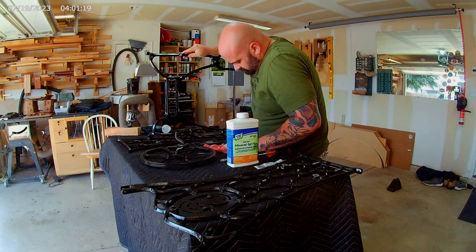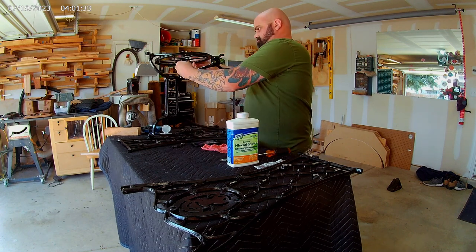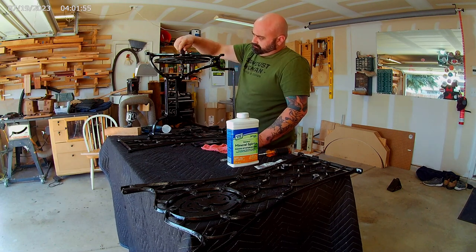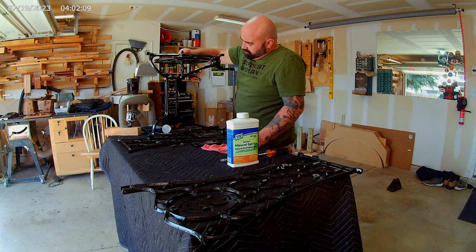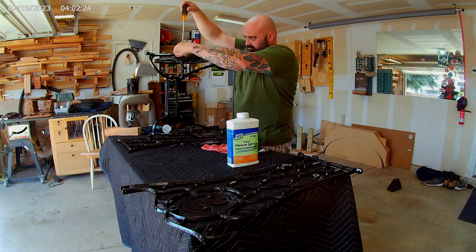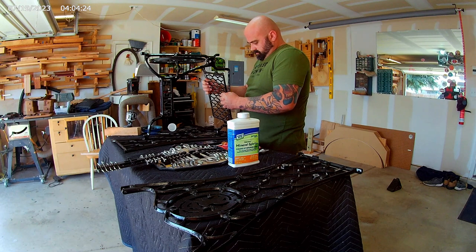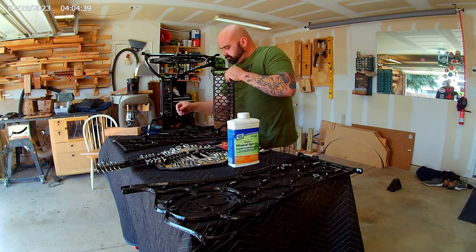The drive wheel is attached on this drive shaft and held in with a set screw that was lost in time somewhere between me, the powder coater, the gods, whatever. But the snug fit allows it to go unnoticed. The drive shaft is pointed on one side to sit in a mating cup and bolted on the other end for a friction ride. Again, I applied some of this grease to the mating surfaces.